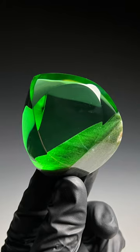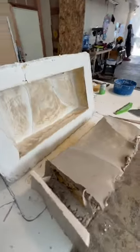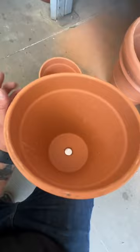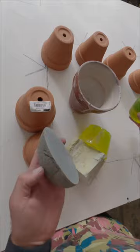This is the easiest, fastest, and cheapest way I use to cast glass for pieces like this. You can use the plaster and silica technique for more complex forms, but they're pretty messy and they're very heavy. So I just go to the garden section of the hardware store and pick out pots that don't have any cracks, and then I prep them so that I can cast chunks like this to glue to a stone.